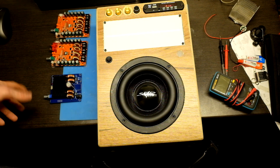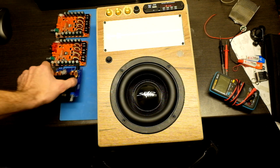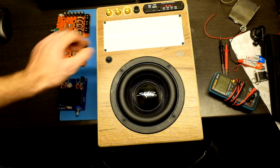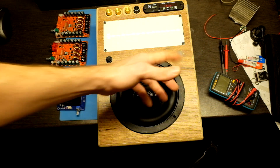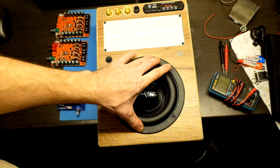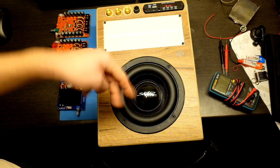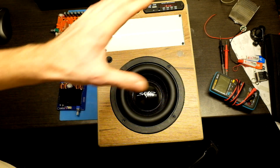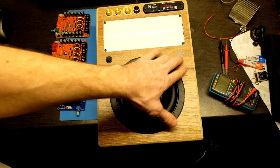I will order a new chip to fix it, and for now just use this amp which is the same but bridged to 1x150 watts. I will connect the 2 coils of the speaker in series so it will be 8 ohms in total. In the end I will use a different amp which can handle 4 ohms and can output 600 watts.